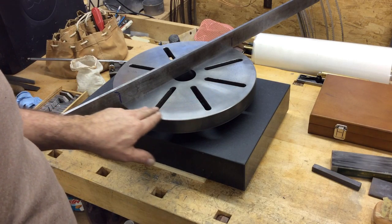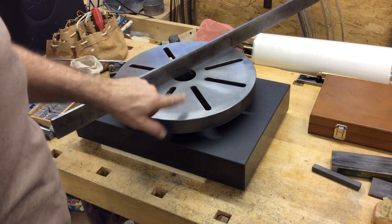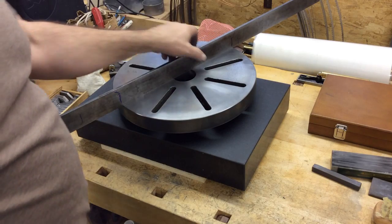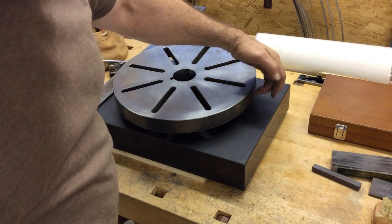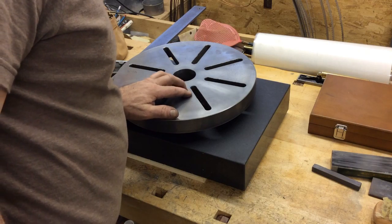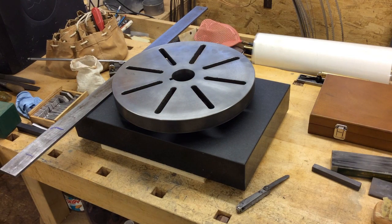It's good enough — I don't think I'm going to do any more to the face. The last little bit was just out about a thou on the end; maybe I could have turned it a little slower. But it's flat and that's really nice. This back edge is pretty far out, and a few people suggested using a boring bar with the tool post turned around — I actually set that up and should be able to reach around and clean up the back edge. It's bothersome seeing that runout when it's running, but other than that the face came out really nice.